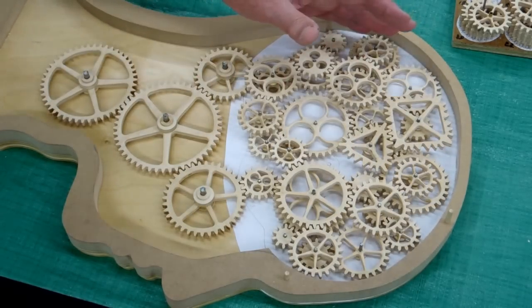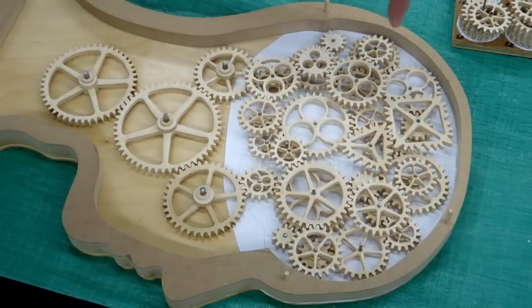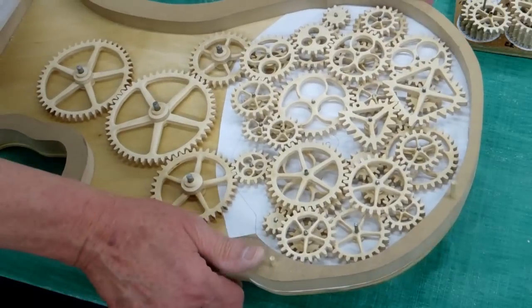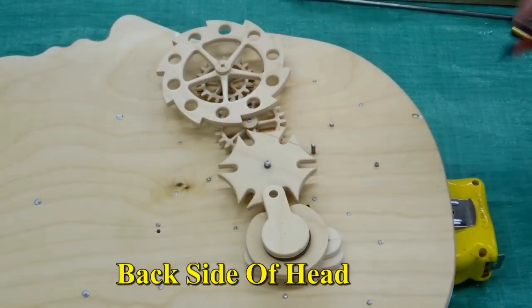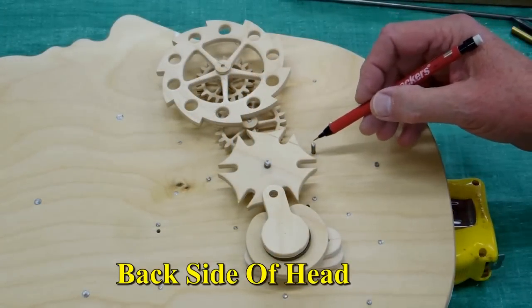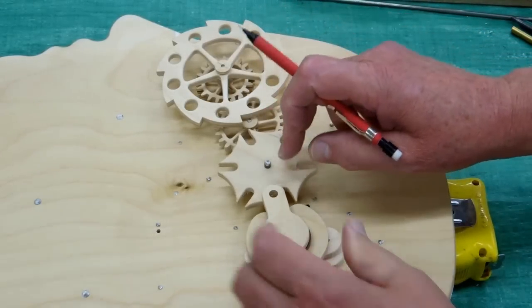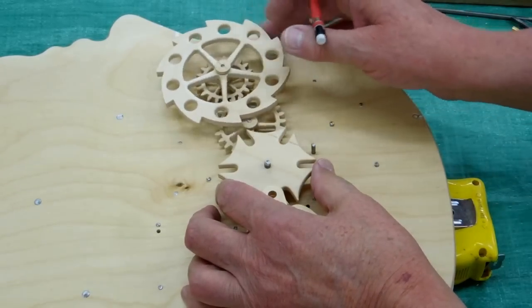I'm driving 10 gears on this side and 25 gears on this side. I'll cross over here off of this half of the drivetrain and come over on the back side. But when possible, I'm trying to use existing arbor or axle points from the front side. I was able to do that for these three gears. And there's a gear under here which turns independent of the Geneva mechanism.